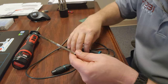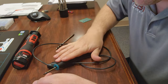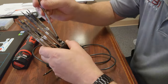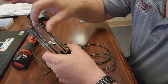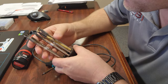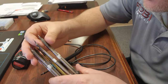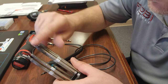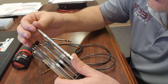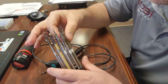These modern ones are the preferred type of soldering iron. This one here comes from my Quick TS 1200A, and these various tips come from a Hakko unit. You can see somebody really went off on the amount of tips they have, but a lot of them are not in the best quality — they should probably be wire-brushed to clean up and then tested. If the contacts are corroded, they need to be thrown out.